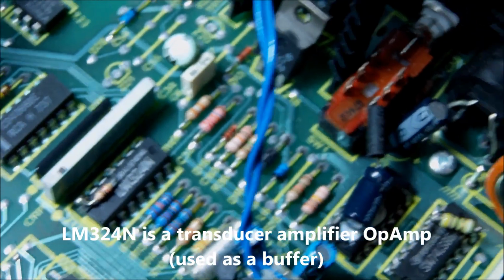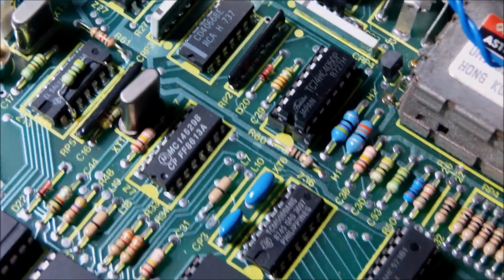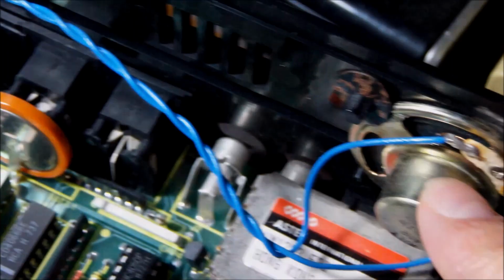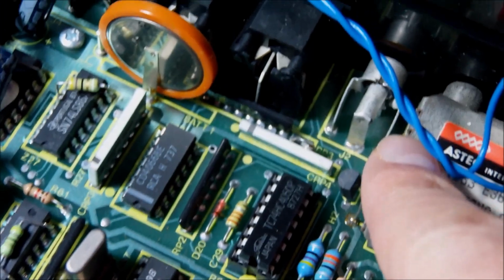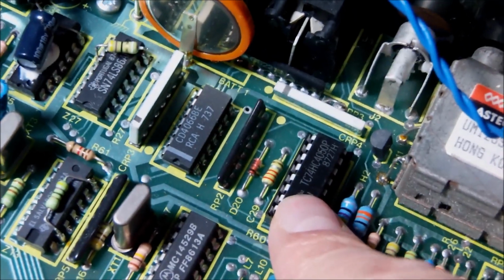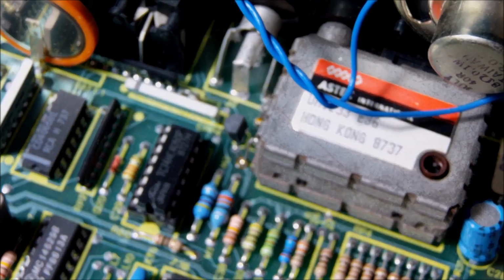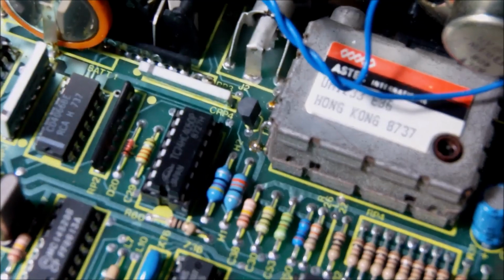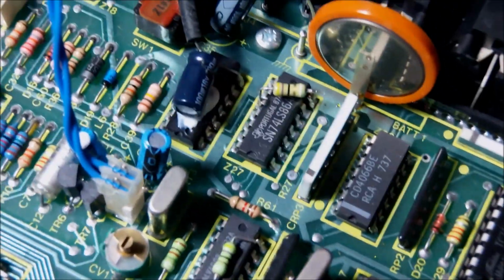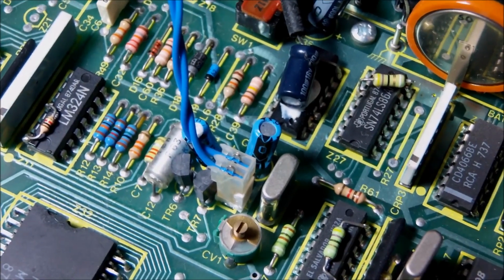I was expecting to see some static RAM somewhere around the circuitry, but apparently this is not the case, and I guess you can tell that this is just a terminal with limited memory capability. So I'm guessing the stored pages for the user are stored inside the MR9735 side CPU, and the interaction goes over this TV modulator or your monitor, and it is in real time, so you get the information that you want from the network in real-time mode. Nothing to store, except if you want to store something on tape, which is possible.